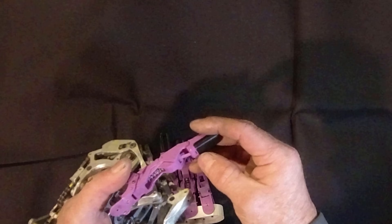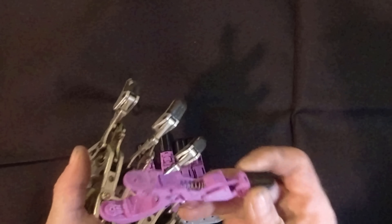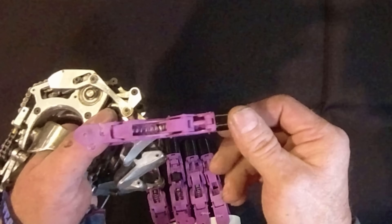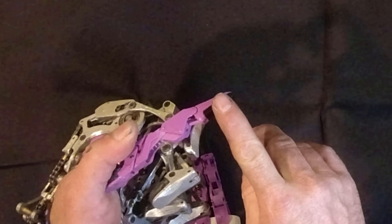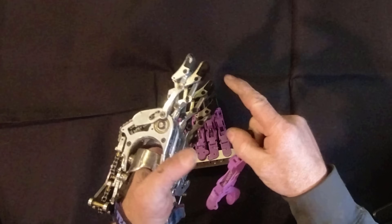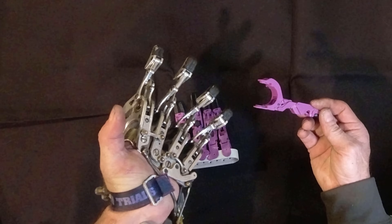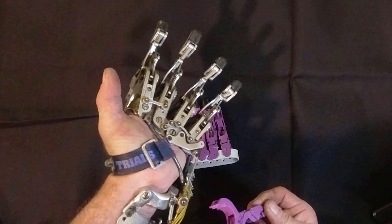One of the things I was able to implement on this that I was pretty excited about — something I've been trying to implement on my aluminum hands for quite a while — is the slide-on distal tactile pads. I print these out of 95A TPU and they just slide on the ABS finger in this version. I've been looking to do that on the aluminum fingers, but I just haven't had the time to program it up, machine it, and change what already kind of works pretty well.